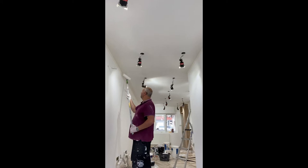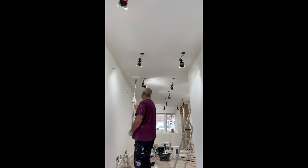So, for example, you can see the ceiling. This is painted, that isn't. I'm not going to go here, I'm going to go here. So I leave about half a brush width and then paint. You don't want things to overlap. Now I'll come here and then stress it out.